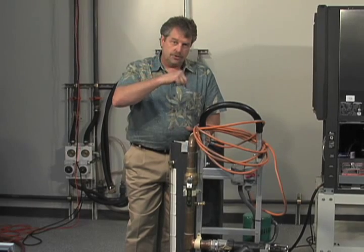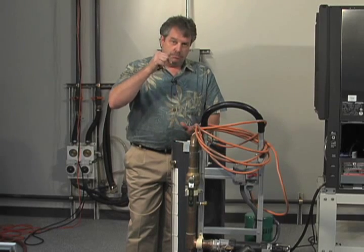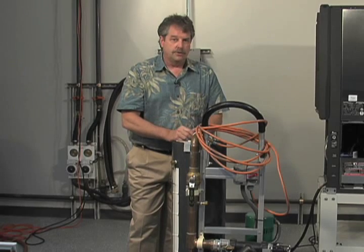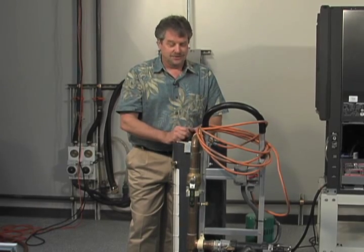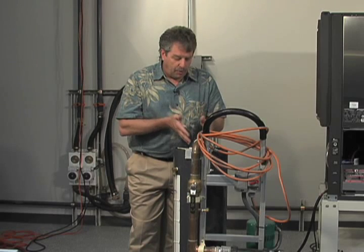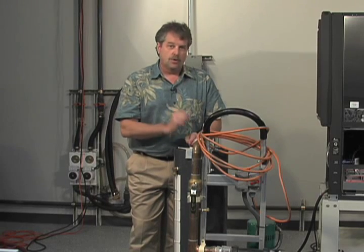You never want to return a pipe straight down, because at the velocity that these kinds of pumps will produce, you could blow your air bubbles right back down to the suction line and take them right back out in the loop field, which means you're going to be there for a very long time not successfully getting that air out. So it's the little stuff that'll get you guys. Make sure you're applying these components as we're describing, because we want you to be successful. We want you to be able to get the air out and go home.